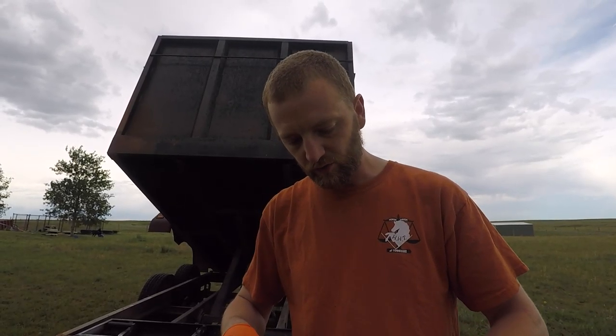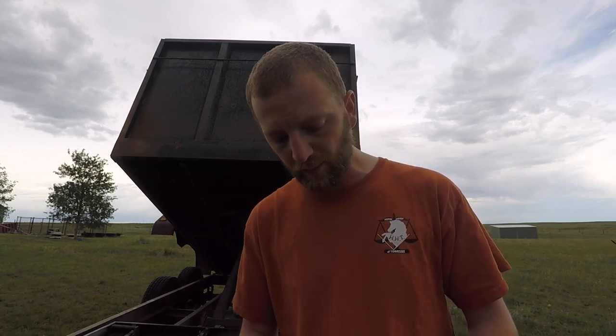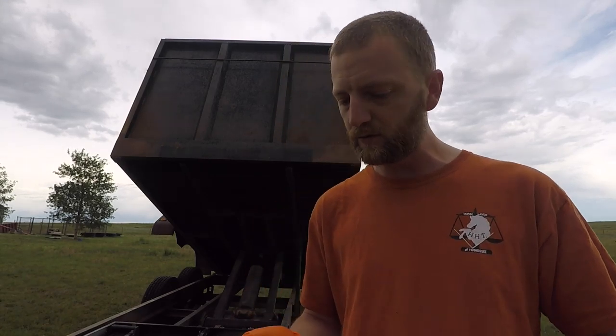From the factory, a wireless control unit is a couple hundred dollar option usually, but I bought this one on Amazon for under $15. It comes with two remotes and the relay. This is actually the second one of these I bought — the first I used on the winch. One thing you'll notice is these remotes say 'out' and 'in' instead of 'up' and 'down,' because it's advertised to work with a 12-volt off-road winch, but it works with any 12-volt system as long as you want a momentary button.